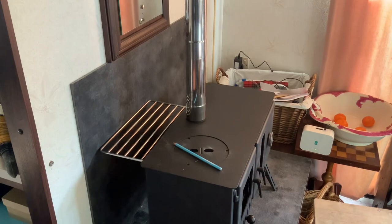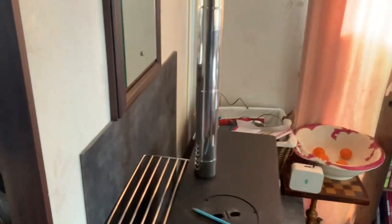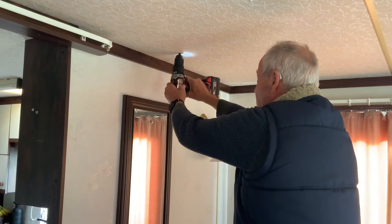For the installation with my father-in-law - to find the hole in the roof, we're going to drill through the caravan roof. We put the pipe on and literally put a pencil at the top to get the blue mark, so that's all you've got to do to find out exactly where it lies at the top. We came up with 100 ingenious ways and then realized that actually just does it. There's quite a distance between the stove and the caravan roof, but that's our guide hole for the circle cutter.